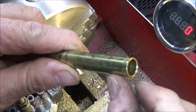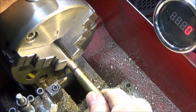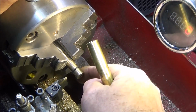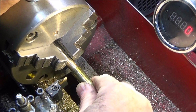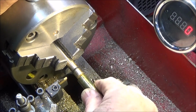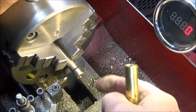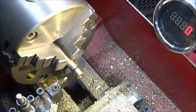When checking that, make sure you have a nice chamfer on the actual tube, and if it was too tight, like I say, to push down, try a bit of Vaseline or silicone grease on it first before taking any more off. You want just enough squeeze, like that. I can actually feel that's very good. It's not actually shearing the O-ring with the tube, and I can do the other O-ring groove exactly the same.